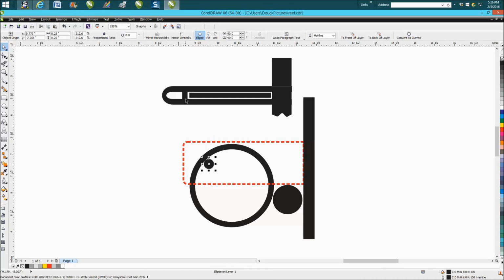So all I did is, after I had it bent, I drilled a hole 1/4 inch all the way through it, cut me a piece of 1/4 inch round stock to that length, and then just lightly welded the two ends in, and then it won't go anywhere. Because this is the key ingredient where this is placed. It could actually be a little bit higher in your drawing. You have to take yours and just figure out, but as long as it's on this side of the ring, it's going to allow it to open.